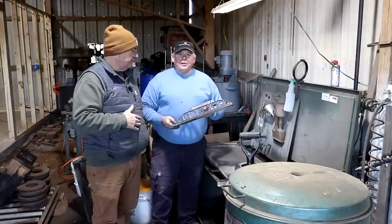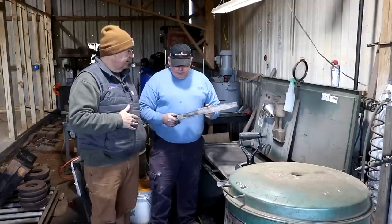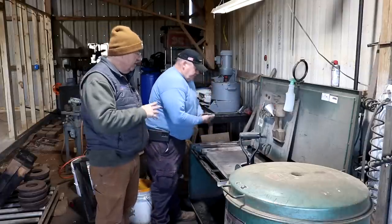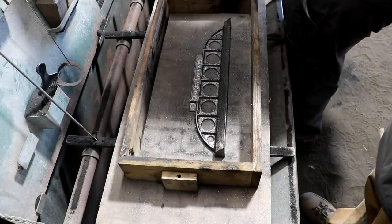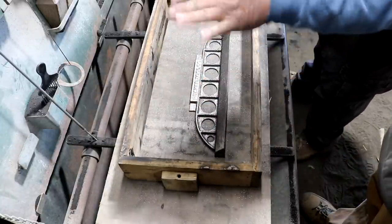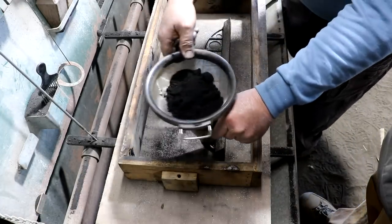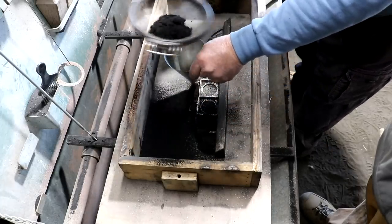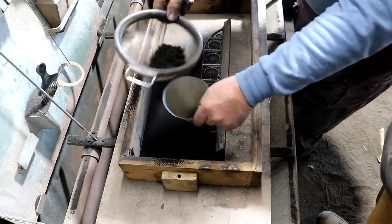Hopefully the detail's showing up — we probably should have shown these before I covered them with oil and graphite. We're going to get started now. The first thing I want to do is put my finest sand down around any of the detail. Any faces that are going to be up, we can easily do that now — just concentrating the finest sand here. And then once we get that captured with this grain size, we'll move up and speed it up.